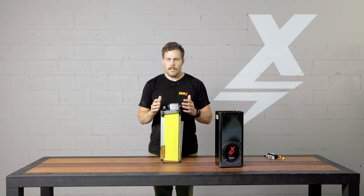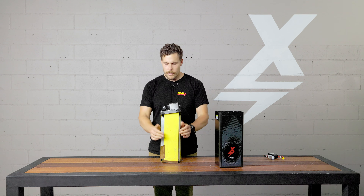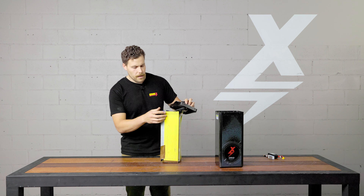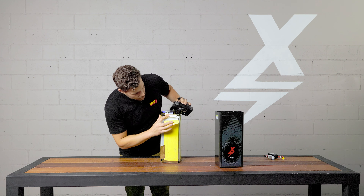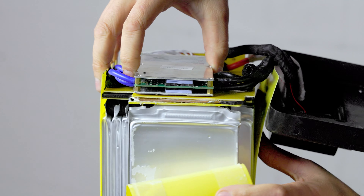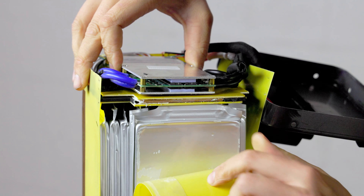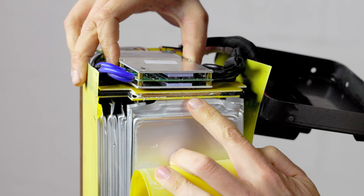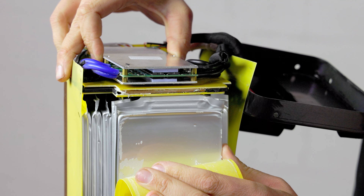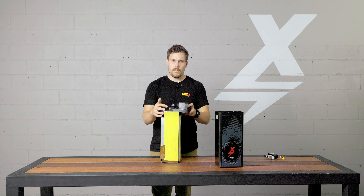As you can see on the battery, the full battery is lined with fiberglass on all the sides, on the bottom, and in the top as well. With all the cell connections at the top, you have to join the cells running on the side to the cells running in the front of the pack, and we have a massively thick copper bar that's machined out and connects those up. So there's no issue with heat going between those two sides of the pack.